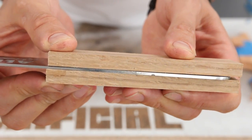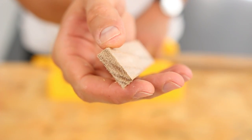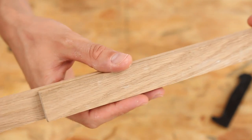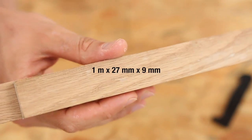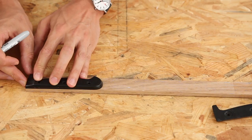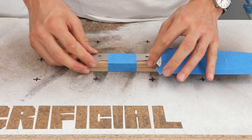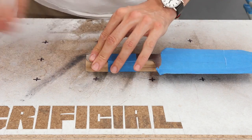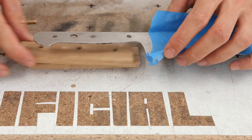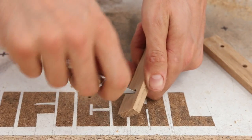You can make scales out of many materials, but I'm choosing oak wood because it's nice, available, hard, durable, and quite cheap. I bought a one-meter strip of 27 by 9 millimeters at my local hardware store for about three bucks. Cut two pieces to the length of the previous handle, then tape them together with the blade sitting on top and drill them with the same metal drill bit. Drilling the holes this way allows for better alignment.